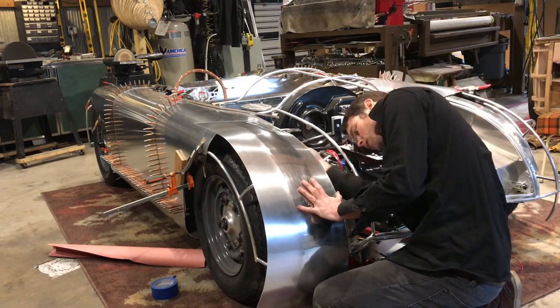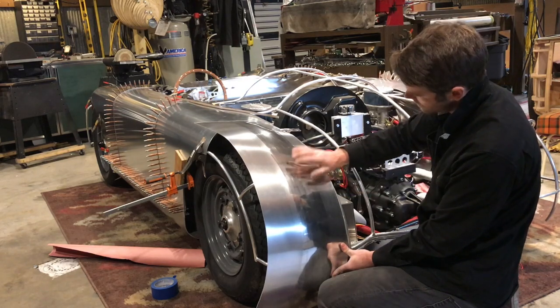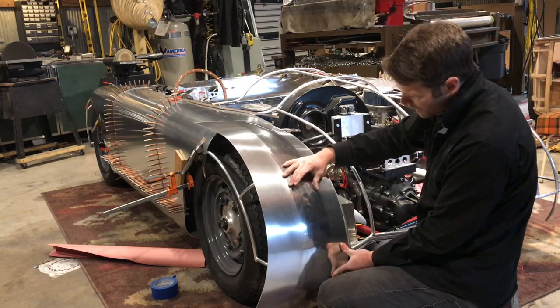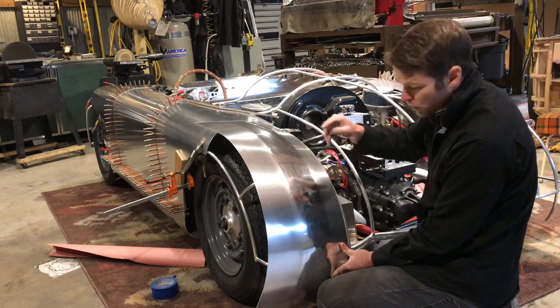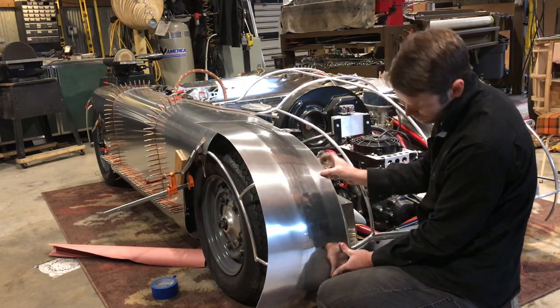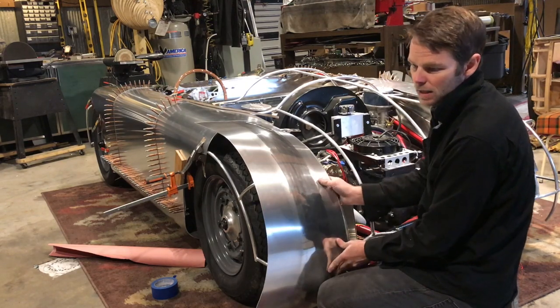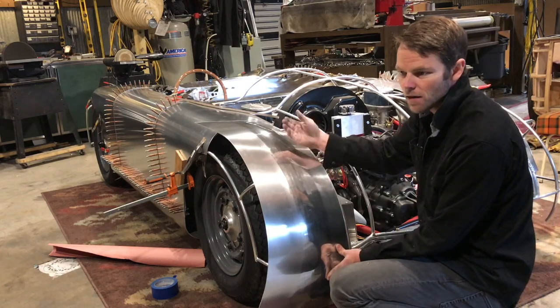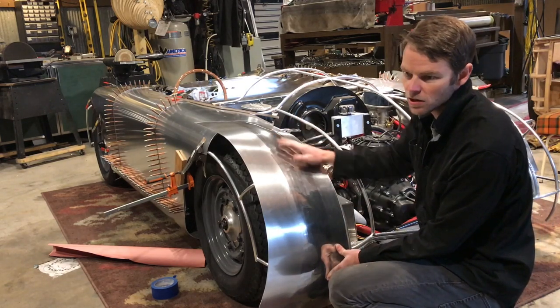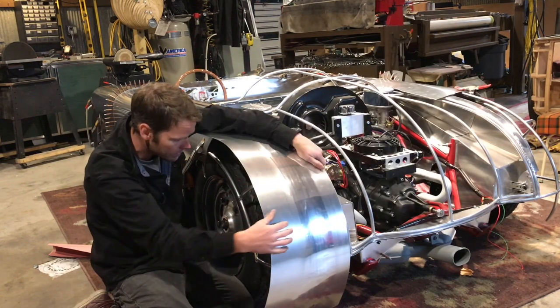Really good. It's touching all the way through here. There'll be no problem getting the rest of this. Now, I can see where I've wheeled, so I'm gonna look underneath and make a mental note or draw with a marker, if you need to do that, of how much needs to be shrunk. And to determine where to start shrinking, we're going to identify where this panel is touching and where it starts to lift off of my buck. I want to start shrinking that in.